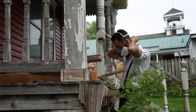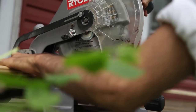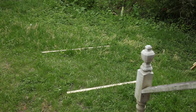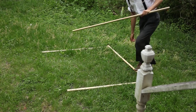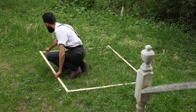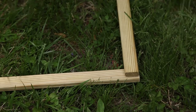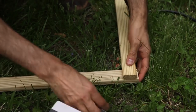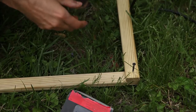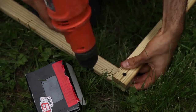Whenever you are cutting wood, especially pressure treated wood, remember to use a respirator and other protective equipment. After measuring and cutting the pieces of lumber, I laid them out as a square on the ground. I had to fix the corners together, and for that I decided to use some leftover short drywall screws. It is a good idea to invest in higher quality exterior rated screws that don't rust when in contact with pressure treated wood and left exposed to the elements, but I was using what I had already at hand.